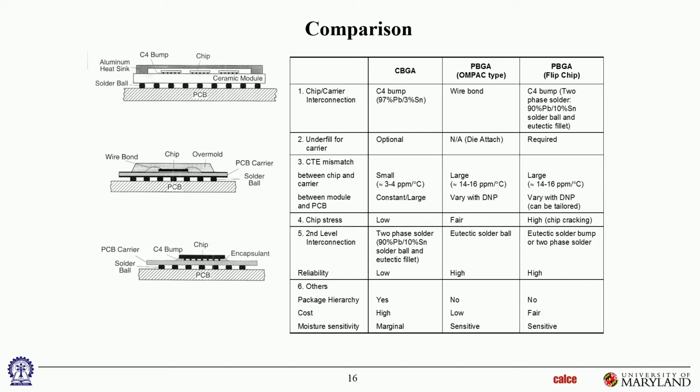What do we call that? There's a name for that phenomenon. Any of the students know that? You guys probably know it. Popcorning? No? Haven't heard the word. It's called popcorning in industry because basically it pops and it delaminates and the package cracks and delaminates with a popping sound. And I mean, we've seen this many times in the lab itself where we've done controlled tests just to study popcorning. So we have allowed moisture to ingress and then spiked the temperature to 250 degrees C, and you get explosive failure in the package. It literally cracks and pops open for the moisture to escape.